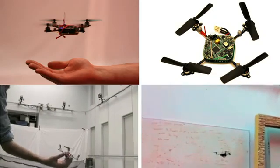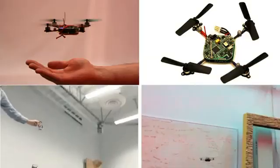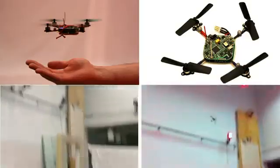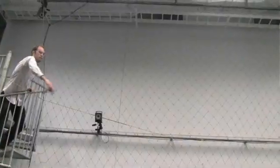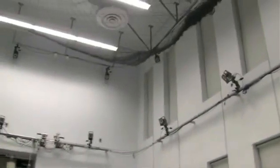This should be clear in these videos. On the bottom right, you see a robot performing a 360-degree flip in less than half a second, and multiple flips in a little more time. The processors on board are getting feedback from accelerometers and gyros and calculating commands at 600 times a second to stabilize the robot. On the left, you see Daniel throwing the robot up into the air, showing how robust the control is — no matter how you throw it, the robot recovers and comes back to him.